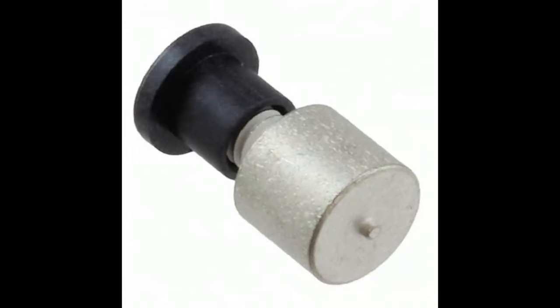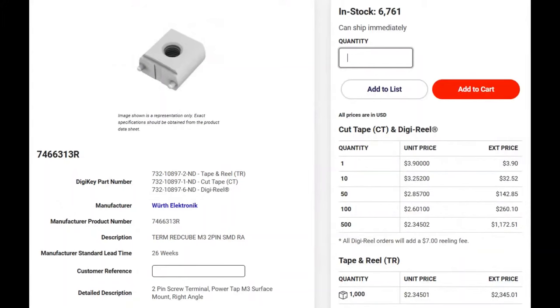They also have some cool options. This one has the placement cap on top — that black cap is the pick-and-place cap — but this is a male threaded standoff used as SMT, so you pick and place it and it has threads rather than a socket pointing up. They also have this very cool invention: the right-angle SMT nut, called the red cube. Two placement dots get pasted down and soldered to the PCB, and then you can attach from the right angle. I've never seen these before — you could use them where you want something attached to the side of the PCB, like with right-angle switches or right-angle pots, for easy side panel attachment.